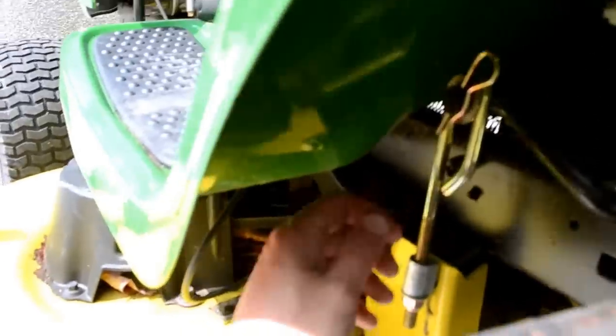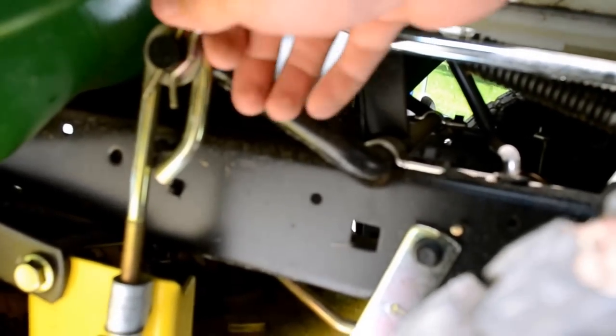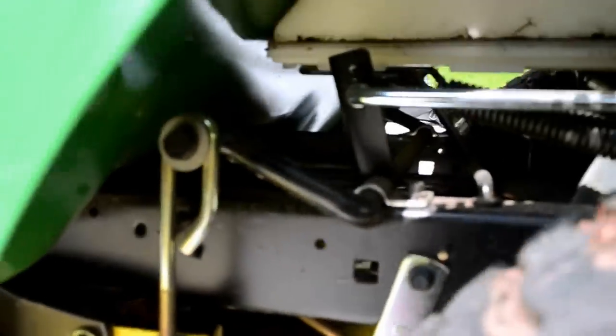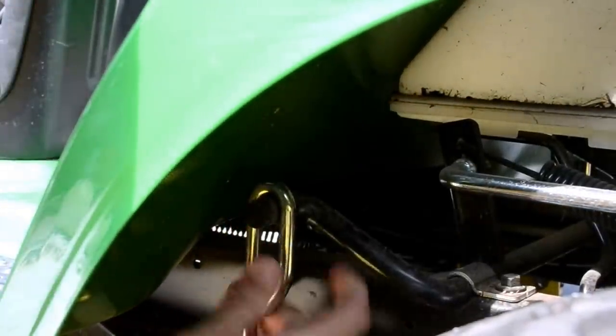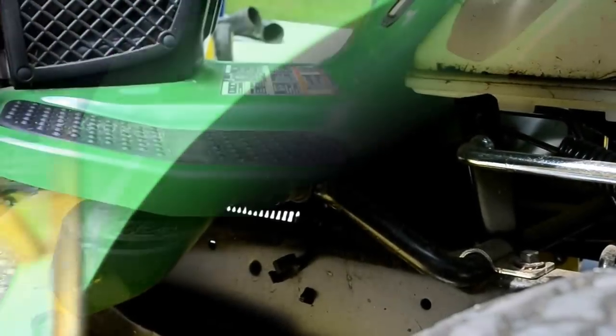From the rear left, holding the deck up right here, we've got a cotter pin. Just pull straight up — you might want to use gloves. It's easier to forgive a slip wearing gloves than to scrape a knuckle. Pull that out — there's one. I just took a washer off of that. Now we're going to lift this up — two hands — lift this one up and pull it off. This kind of just sits in there with that camshaft-looking bolt that slides right in. Keep the screws and nuts together; we're going to put them back on in about half an hour.